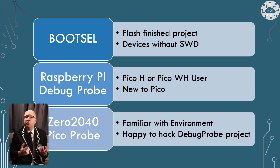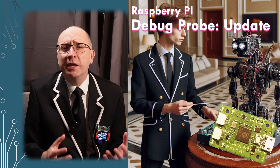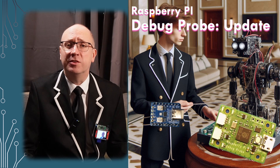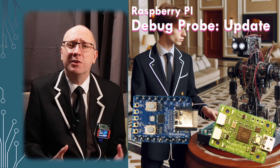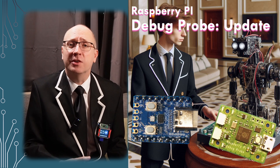If you're not using the pre-soldered header version of the Pico — the Pico H and WH — and have a little experience with the Pico ecosystem, then I think an RP2040 Zero as a Pico probe is a great option for SWD flashing. I still think the debug probe is a great product, but in some situations I can get by with a Pico probe running on an RP2040 Zero. These are in some ways better because I've got USB-C, which I find easier in my environment, and no JST-SH connectors.